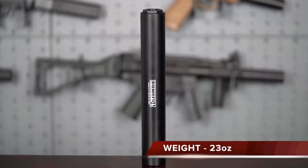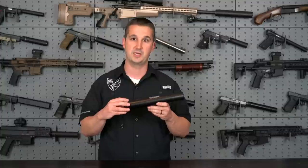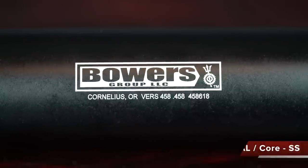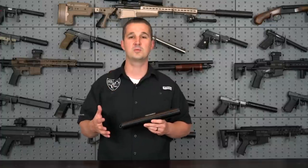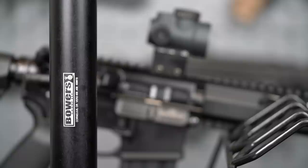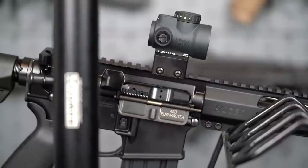The tube is constructed of aluminum with a nice black anodized finish, and they offer a no-upcharge switch to Red Dawn Rose, which is more of a pinkish anodization color. The baffle stack is machined stainless steel. A really important aspect of this suppressor is there is no minimum barrel length restriction, and it is full-auto rated — so a very durable can with no factory warnings or restrictions. It's going to run what you brung.